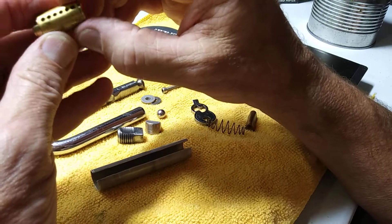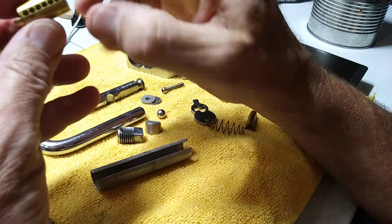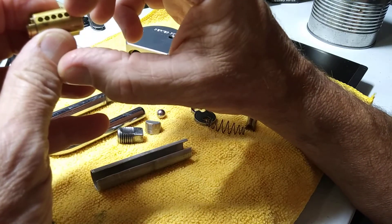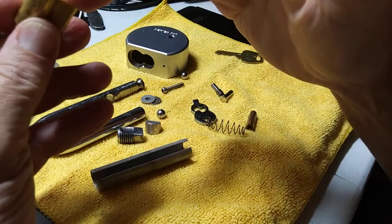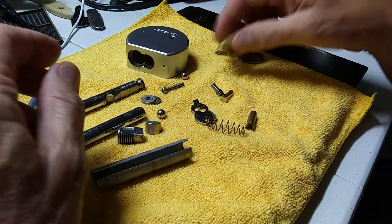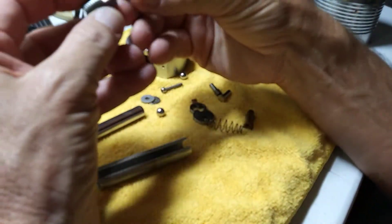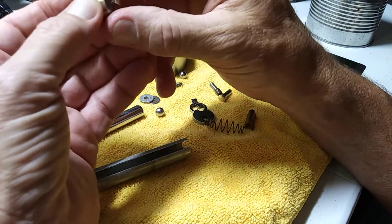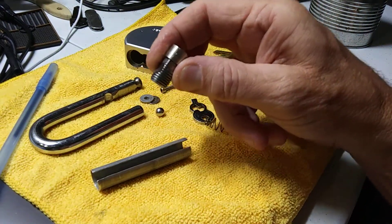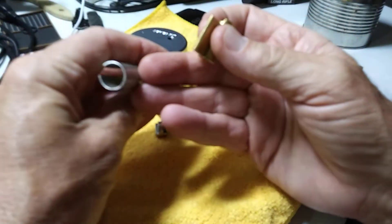If you put spools in here it would make it sloppy to where you could actually pick it, but I plan on putting all serrated pins in here — both bible pins and key pins — so that the picking is going to be really intense. What I'm doing is making my own non-bypassable actuator. This is my go or no-go tube.